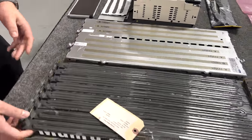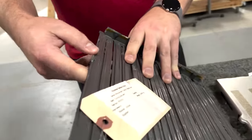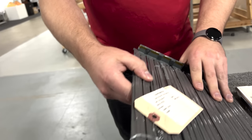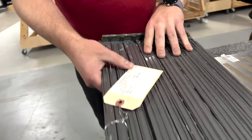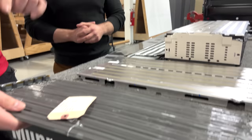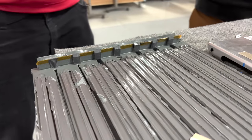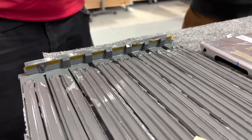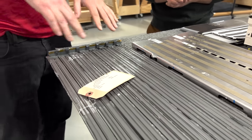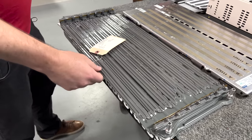Inside the cooling plate strategy, there's a fair bit of very rigid adhesive — sharp enough to cut yourself after it's cured. The cold plate itself is flexible with plastic separators giving it rigidity. The backside has a flat surface and the other side has a tortuous path surface — which is kind of backwards from what we normally see. You generally want a smooth surface to contact your cells for better thermal propagation. To counter it, they've applied a large amount of adhesive to allow that thermal transfer to take place.